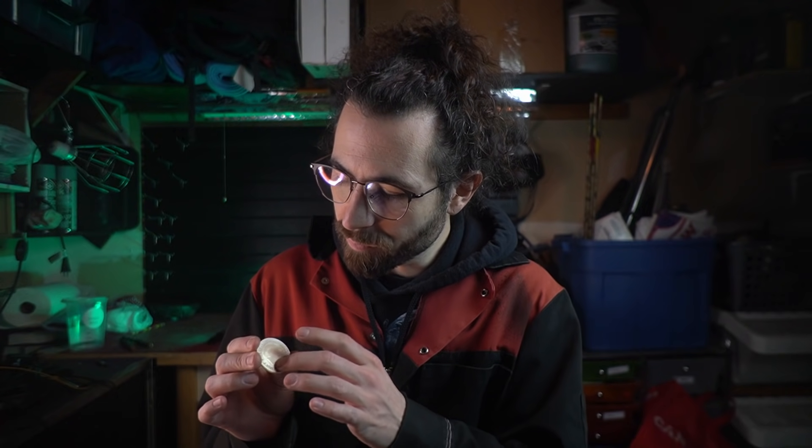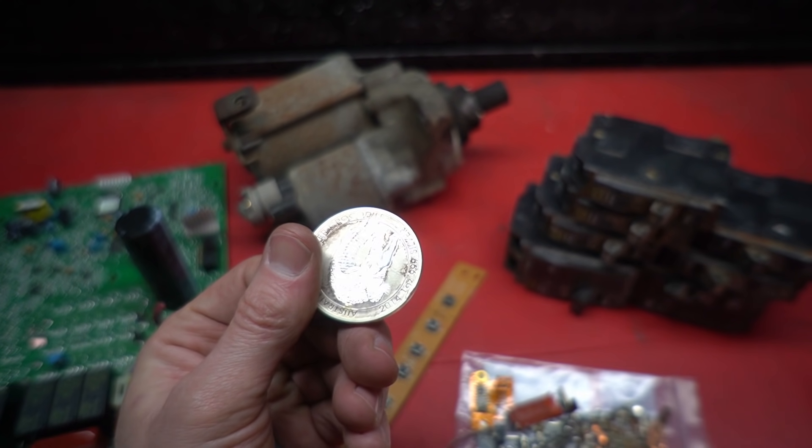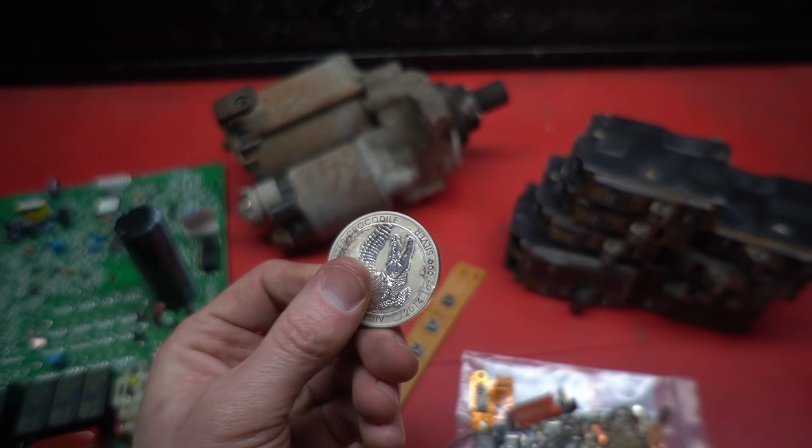There are other places you'll see silver from time to time, so how will we know when we see it? Now silver is one of those things you can train yourself to identify once you get used to it. You'll start to know where to look for it, but the tarnish has a really unique appearance. This oxide layer is more colorful than the kind you'd see in aluminum or zinc, and its blue, pink, smoky, almost iridescent sheen is unlikely to be anything but silver.